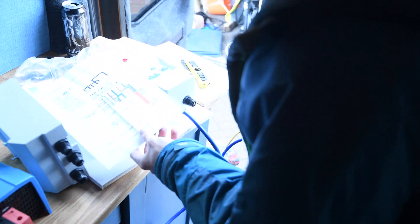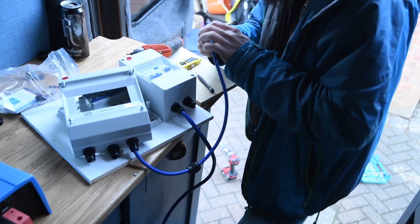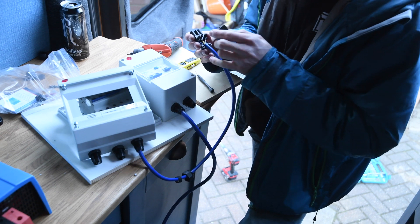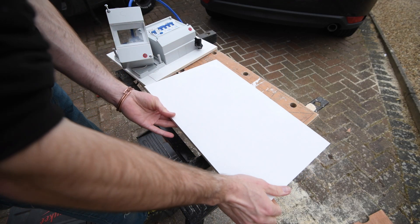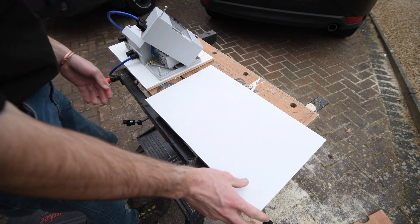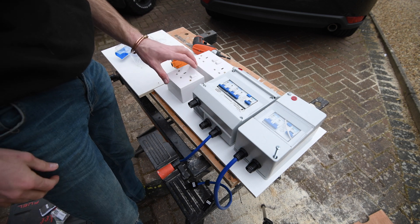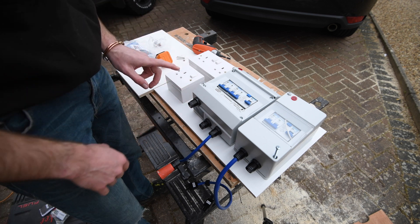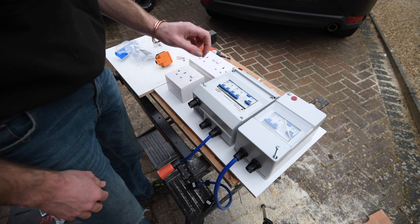Wire diagram again. Blue into neutral, live into that one. Just to point out for anyone doing this: the live and neutral orientation is swapped around on the other plugs, so don't just wire them both the same. Decided to move this onto a slightly bigger board — you'll see in a moment why. I wanted to go for having each of these circuits go to just a 13 amp plug socket. It's a bit easier for me to wire and unplug. I'm going to have one socket for the smaller 6 amp and the dual socket for the 10 amp version.